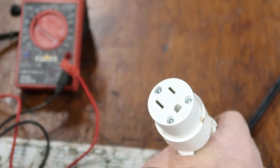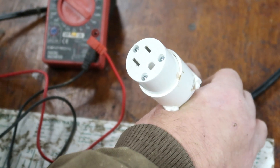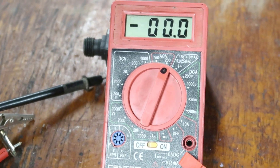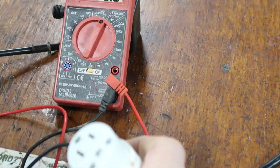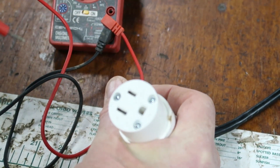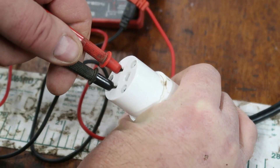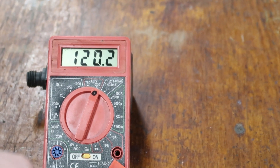Now for the intimidating stuff — AC voltage. This is plugged into the wall. My multimeter has two settings: 750 and 200. Most wall outlets are 110 to 120V, so I'll use 200. I stick one probe in one side and one in the other. It doesn't matter which side — either way gets a reading. I shove it in — it won't shock me because I'm not touching bare wires. The multimeter reads 120V, so this extension cord is good.